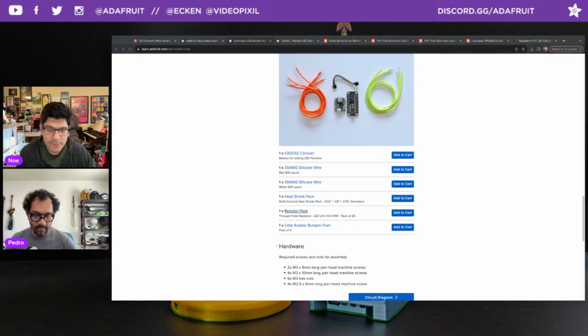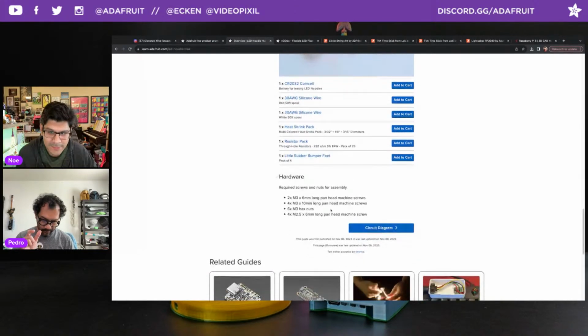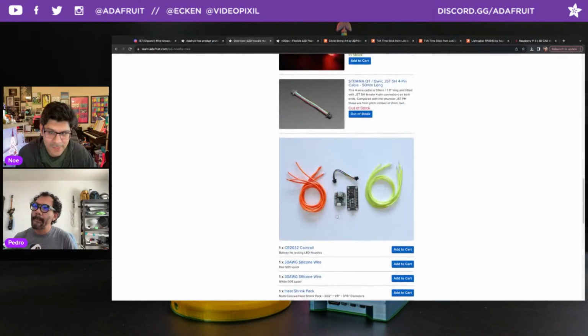So when I originally did the first prototype, I didn't use any resistors, and they power on, but they draw so much current that the CircuitPython drive doesn't mount. This is a very strange thing, but if you look at the product learn guide about the LED driver, you'll see that in some cases where you do draw too much current, you'll want to use a resistor, even though you don't need a resistor on some smaller LEDs. So I think up to 4 LEDs, you don't need a resistor, but once you max out the current, you're going to need some resistors. So that's just the way it is. And then a couple screws here listed, but that's pretty much the main circuit.